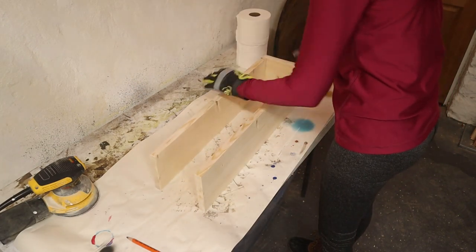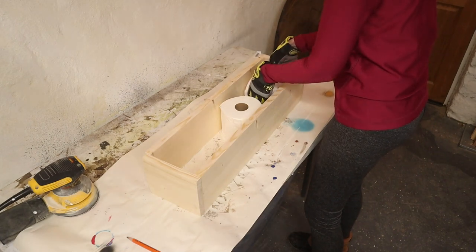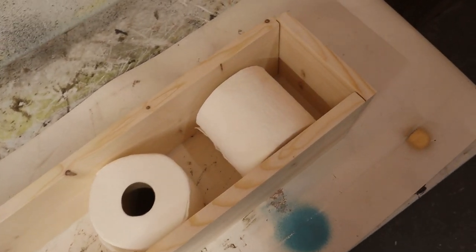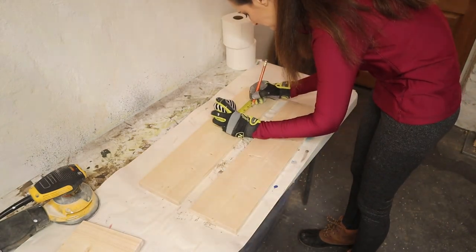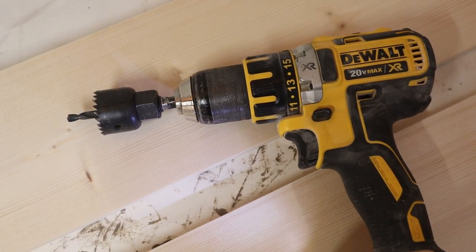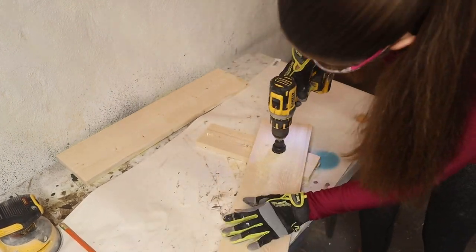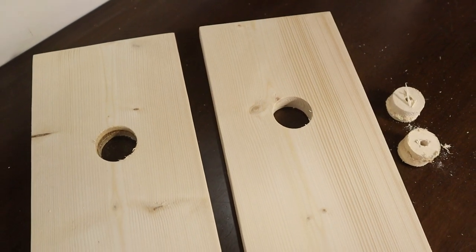Next I figured out how far down to drill holes for the hanging toilet paper roll. I set up the box as if assembled, stacked the toilet paper to gauge placement, then measured down 4 and a half inches. I used a hole saw — the smallest I had, about 1 and a half inches wide — though since my dowel rod is only 5/8 inch, a smaller bit would be better. I centered the holes within the 1 by 6s, drilled through, flipping the board halfway to complete each hole, then sanded smooth.